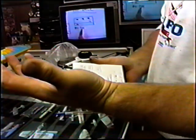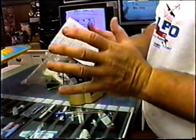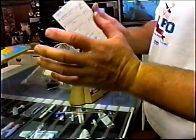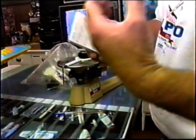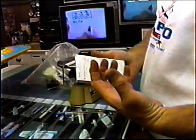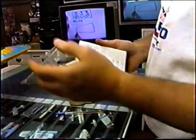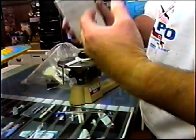is get a weight on the airplane here, a final, not an all-up weight, but just a rough idea of if this airplane is on the heavy side or the light side, or if it's on the nose heavy side or the tail heavy side. Now if it's on the nose heavy side, I need to know where the other two planes balance. Working off that, I can get an idea, if this is nose heavy, what can I do to the front of the plane to lighten it up?